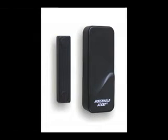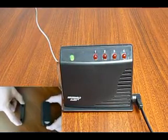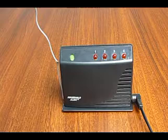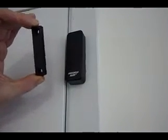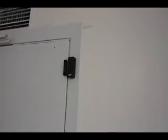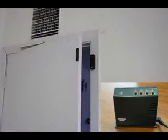The window and door sensor, model WD434TL. After learning the door and window sensor, test the sensor to ensure it is communicating before you install it. To install the door and window sensor, mount the transmitter piece on the door frame with the double-sided tape or the screws provided. Now mount the magnet on the door beside the transmitter where the red marking is. When the door is open and triggered, this will send a signal to the receiver. The alarm or beeping will occur until the door and magnet is closed and contact is no longer interrupted.